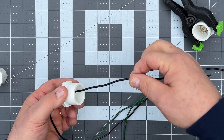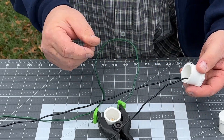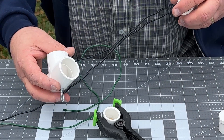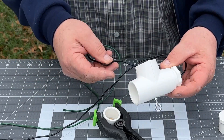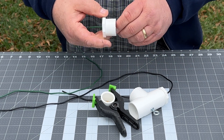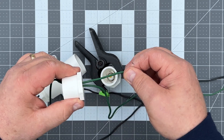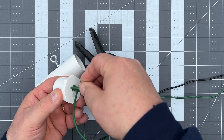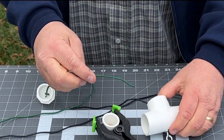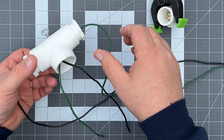On the inside, same thing — that will actually solder to our connector. We can take up the slack again when we get it all soldered up, and then we can measure exactly how long we want this cable to be. Let's simply feed this through so that we can temporarily put that in, and then we want to temporarily do the other side the same way. Go through that center hole, bring about a foot out, sew it back through into one of the other holes, then go back down again. Now we have our two wires coming out on each side.